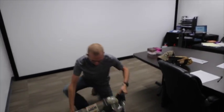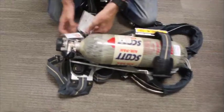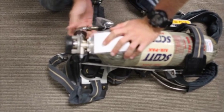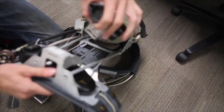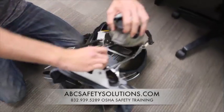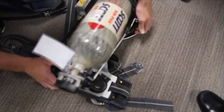So to change out one of these cylinders, place it on the ground, make sure everything's out of your way. Push this little tab right here, undo that first. Come over here, make sure your air is off first. Then come over here and unscrew this — make sure that's all the way unscrewed. There's a little tab right here; push that down. The bottle's going to fall out just like that. Take it, grab your new bottle, slide it in. Whenever you put this bottle in, you've got to match up this little tab right here — it'll pop in right there. Pop it in, so it's not going anywhere. Lock that down.